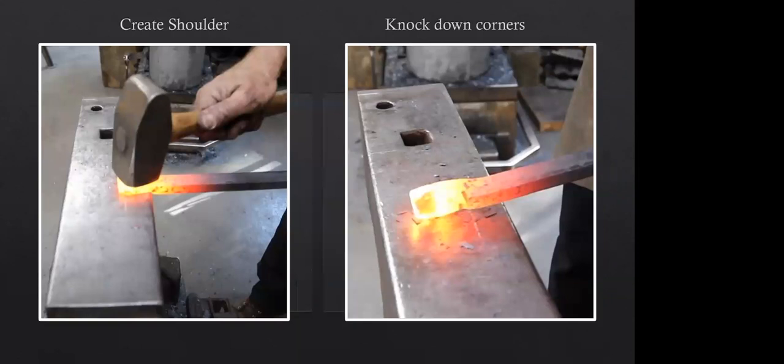There are a couple of stills here. This is where I'm setting down the end — I'm going to flatten the end of it to three-eighths and keep the regular bar three-quarters of an inch. You may be able to see a chalk line under the hammer on the picture on the left — that was the index mark for the bar. You need to keep it tight up against the anvil and then flatten it there. I was not concerned about it getting wider there — I thought that would be a nice element if it were wider than the three-quarters. I did want to chamfer the corners and the edge facing in toward the sign.